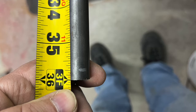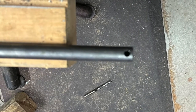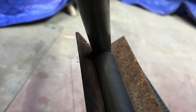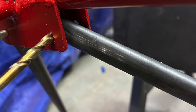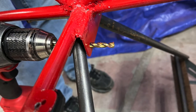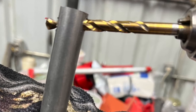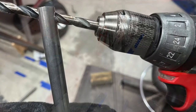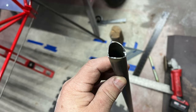Here's how I drilled my holes and found the correct angles. First, I drilled a quarter-inch hole a quarter inch from the end. With a quarter-inch bolt halfway through the tube, you can then place the other end of the leg at the edge of the angle iron. Having a helping hand would be helpful here — I just used something to hold it in that location; blue painter's tape worked well. Then I drilled through the front side of the tube, holding the drill square and level. You have the correct angle drilled. I transferred these locations and repeated for the leg on the other side, then drilled these quarter-inch holes to three-eighths inch for the bushing. Finally, trimming the end and hammering it around a drill bit to get ready to weld.